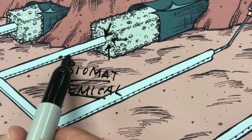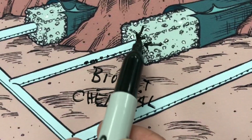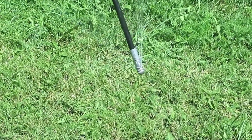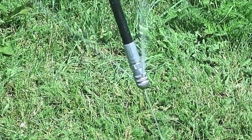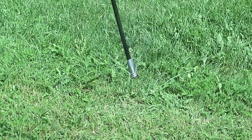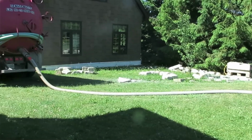You've probably never heard of this technique before, but a pressure washer can save you a 5-figure septic rebuilding job if you've got a septic system that's failing for the usual reasons of clogged leaching pipes. So you connect a long, flexible jetting attachment with a self-driving head. Your pressure washer becomes the engine for cleaning the inside of the leaching pipes that are at the heart of most septic systems. Have your septic tank pumped so you have at least a couple of days before sewage starts flowing out into the leaching bed again.